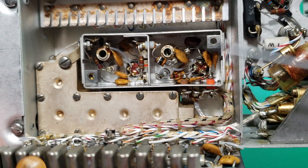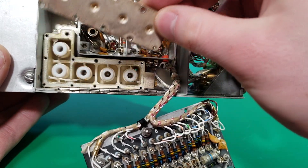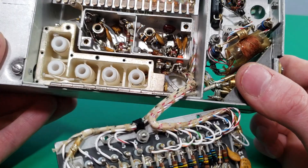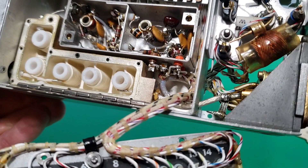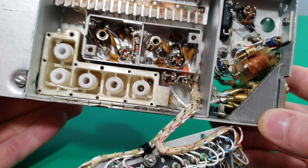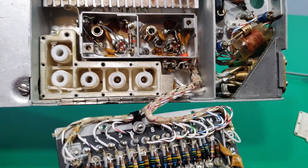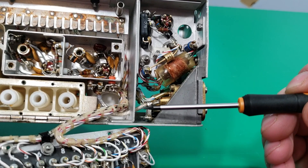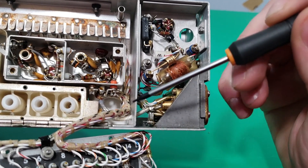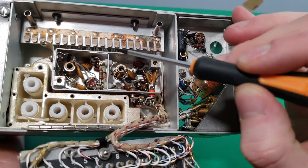Now let's take the cover off the other module. To get to the screws I had to remove the board first. Removing this silver-plated cover reveals a cavity containing what looks like inductors — just wrapped-up coils of wire inside cavities. That means those large screws on the back are for adjusting these cavities. The back side of the cover has little bumps that correspond with the coils. To clarify: the antenna wire actually loops around and enters this cavity block first, then exits and goes into the adjacent compartment.